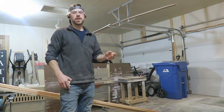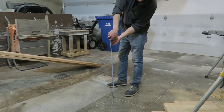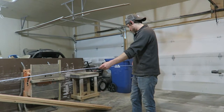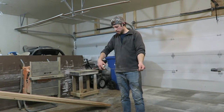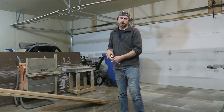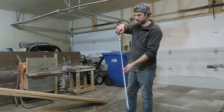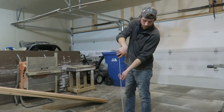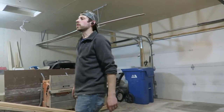Trust me, I made all the tables that height. You're gonna have 31 inches in height, and you're gonna have 6 feet, so 72 inches long, and then 40 inches wide. That's about the dimensions of our table right now, minus the height, because the height of our table is a little high, so it'd be kind of specialty chairs to do it, and we want a little bit more normal height table. So we're gonna go with 31 inches. That's pretty standard, right about there.